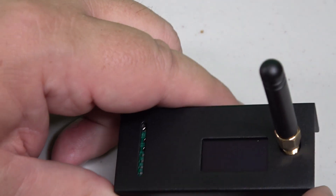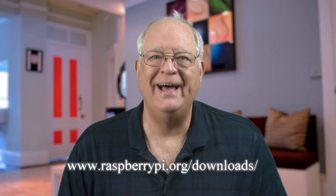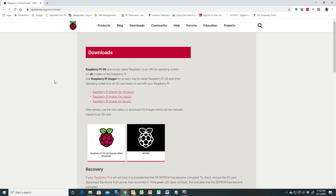This whole project took maybe 20 minutes to assemble, and now we're moving into the programming side and getting the SD card set up. There are several YouTube videos about how to set up a Raspberry Pi operating system on an SD card. There are two basic ways: one is to go to www.raspberrypi.org/downloads where you can place a Pi-Star image on a new SD card — I'd recommend not formatting it, just start with the imaging process on that page.